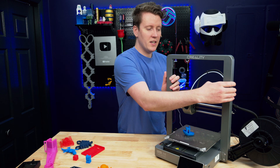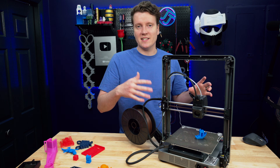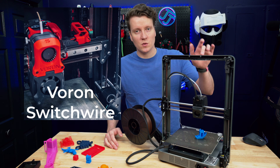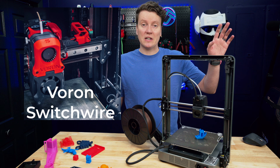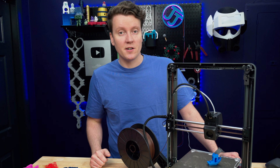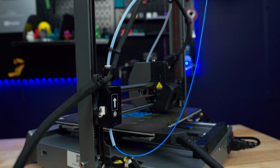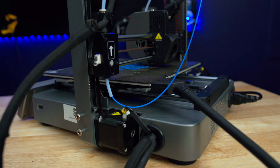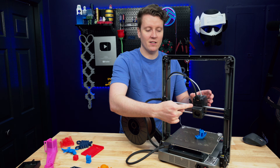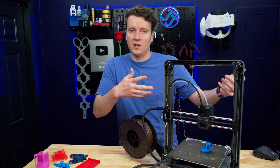So what is the big benefit when it comes to Core XZ? This is the first commercially available Core XZ 3D printer. The only other popular Core XZ printer is the Voron Switchwire, but it's more of a kit you have to build yourself. The motors are hard mounted down on the bottom of the base, so all that weight is rigidly mounted down low. It uses long series of belts that go up, around, over, and down, then connect to the hot end — basically a Core XY motion system turned vertically.